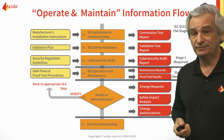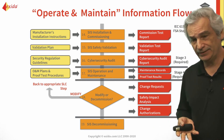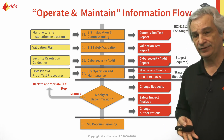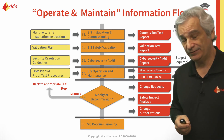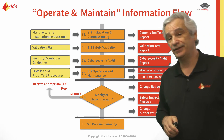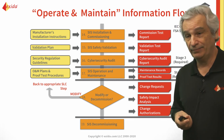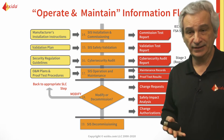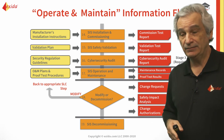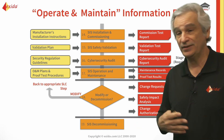Once you've done that and passed the FSA3, then you can start up. Once we're into operation and maintenance, any changes need to be handled carefully under management of change, and we would do another functional safety assessment on changes. The standard also calls for a periodic performance review — it uses the term 'periodic' because it's not going to tell you what that period is; you as the end user can define it yourself. You might choose the five-year window between PHAs, which gives you enough time to have done maybe two or three proof tests depending on your frequency.